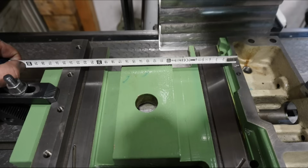So I drilled this hole here. This is the top piece of the bed slide back from the EDM company, so with the deep holes already in it. And you can imagine how thrilled I was when I drilled that transfer hole, whether or not I would be hitting the deep hole. And tell you what, I didn't hit anything at first. So I drilled 2 millimeters deeper than planned, but I still didn't hit that deep hole. And I thought, well, now all that money for the EDM hole drilling is wasted.